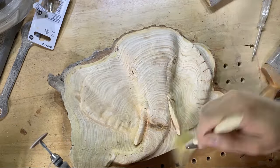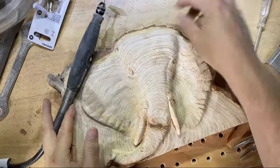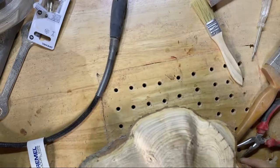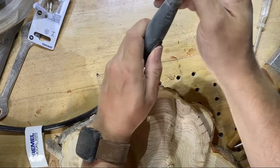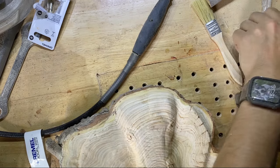I hope you'll agree it's starting to look really good — really smooth on the finish, which is what I want. Because as soon as I apply the final finish, anything that isn't smoothed out will show. I'm just changing the mandrel now to the final one, which is a 320 grit, and I think that'll give me the smooth look I'm after. Then we'll apply the final finish.